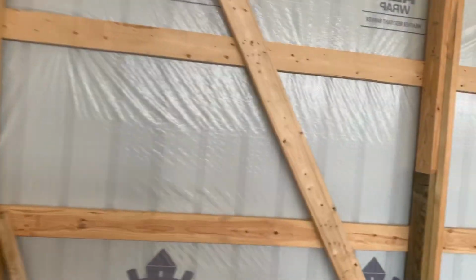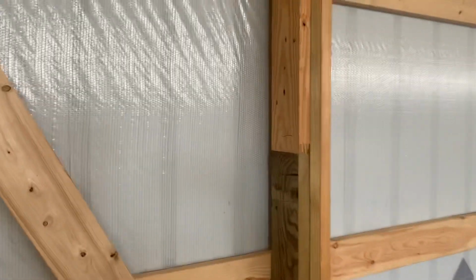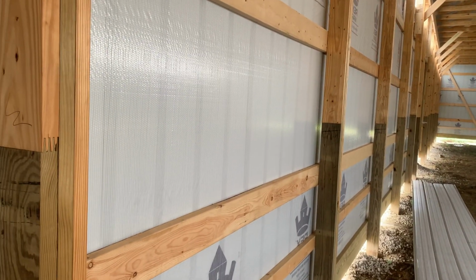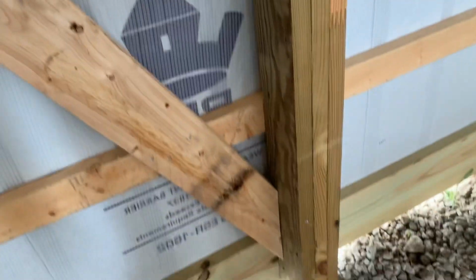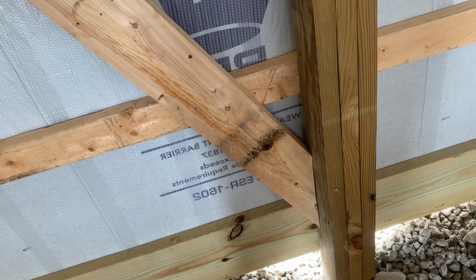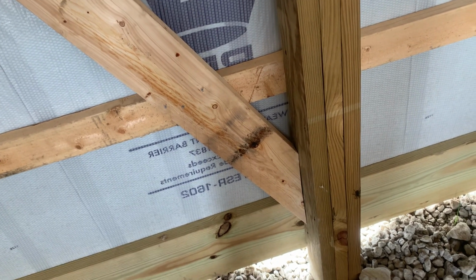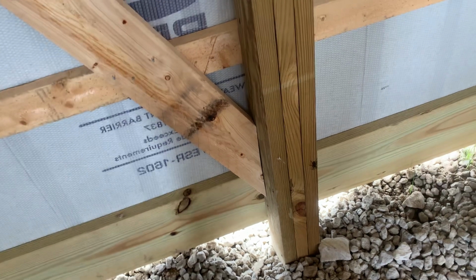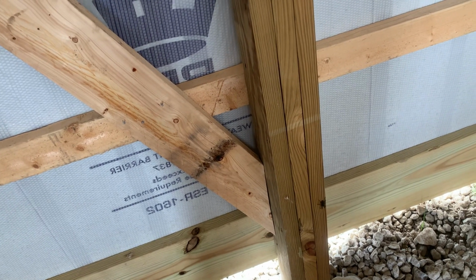So the quality of the lumber is pretty important versus a number 2 grade, or I guess you could even drop down to number 3 grade, but I don't know if you would want to roll like that. But 3-ply laminated columns, we use that. Again, in previous videos, you probably saw concrete permacolumns, wet set brackets. On this building, the customer said 3-ply laminated columns make sense. We see this application and use quite a bit.